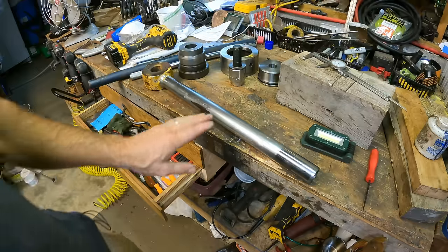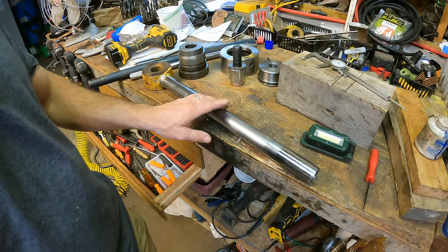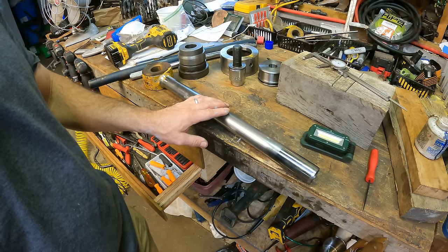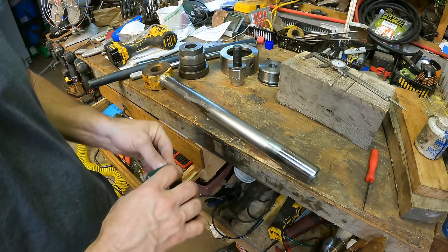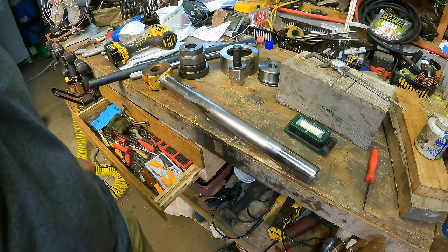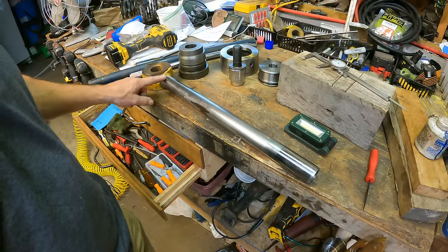All right, I've got several challenges that I'm not sure how it's going to go. One, these rods might be hardened, and I have carbide tooling, which should be able to handle it, but I don't know. It's probably not top-of-the-line carbide, so we'll have to see. The ones I bought are definitely hardened, so same issue there. I'm going to need to do some turning on them.